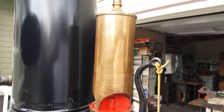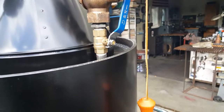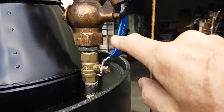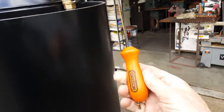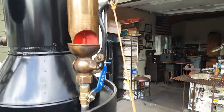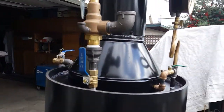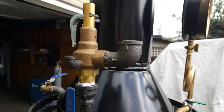The whistle here is the best three-chime whistle I can find. It requires a valve here to make sure it's working properly, and once it is, I remove this valve. The handle cord here is shoelaces from a logger's boots going over the other side. The pop-off valve is set at 125; I'm going to change it down to 100 when it comes — I just haven't received it yet.